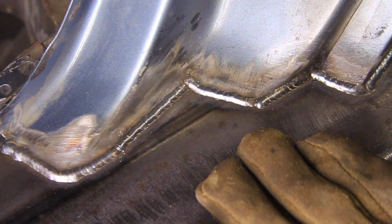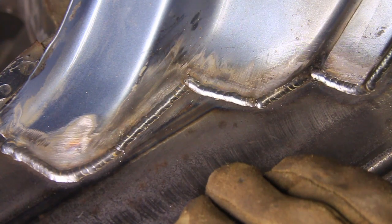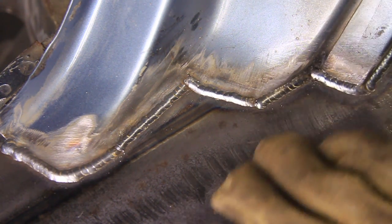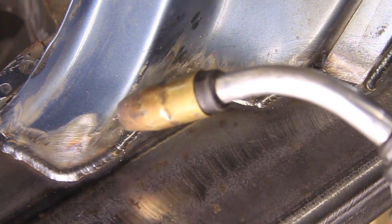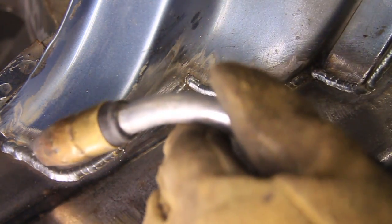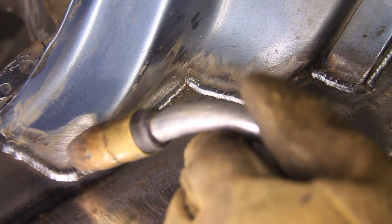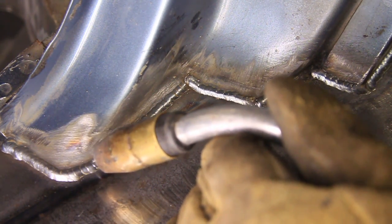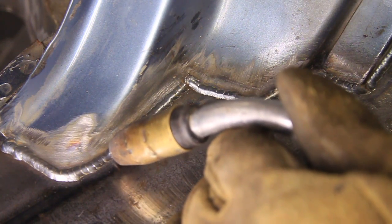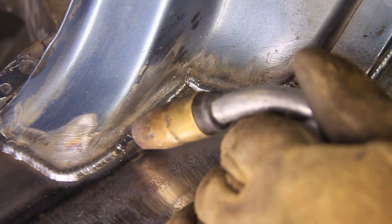One other thing I wanted to mention is that I used a friend's welder the other day, and you'd think I was the worst welder in the world. So having a good welder makes all the difference too. The proper tools. To recap, basically all we're doing is welding on that thick stuff, and we're just making either cursive E's, or you can just make a loop like a U, like we're doing a bunch of U's. As soon as that puddle gets hot, you just move it over and it'll melt right into the sheet metal, and then you just continue along.